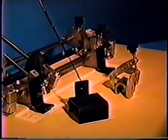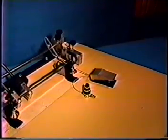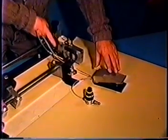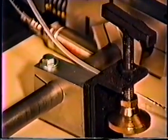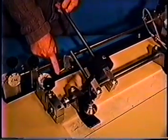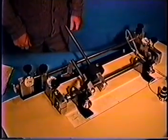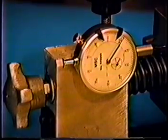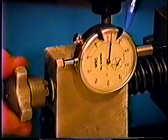Optional clamps are available for special frame clamping requirements. Devices are also available for lifting and holding the frame in the non-print position — this includes the pedal and air cylinder assembly, as well as a ratchet lock assembly. Dial indicators are also available to display in thousandths of an inch the adjustment movements of the screen printing frame in the x- and y-axis.